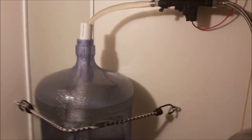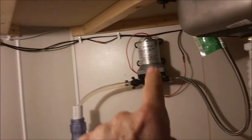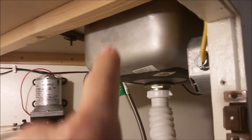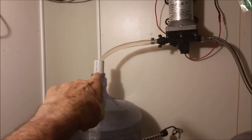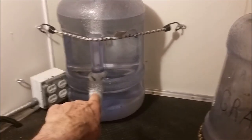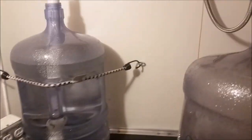This is how I got water. I have five gallons of fresh and five gallons of gray. This goes up into my low voltage pump, which is powered from that, and it pumps water into this sink I got at Home Depot. The water goes out of the sink and down into this. I saw this online — I'll post a shout out — the idea is you just cut a piece of PVC and it drops down into the bottom. You drill holes in the bottom and run your hose down through that, because if you don't, the hose will just wind up. This way it keeps it all the way down — it works really good.